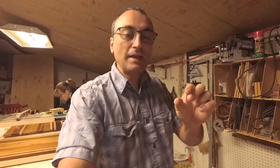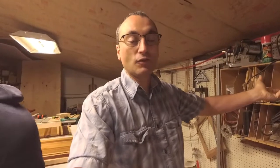But what we're going to do is build the bus out like you're seeing, and then I'm going to put the floor in, and I'm going to leave a good space around everything. And then put mop boards in the bus as well to cover some of that space. Another important thing is to put the flooring in the bus so it can acclimate to the temperature that it's currently at.